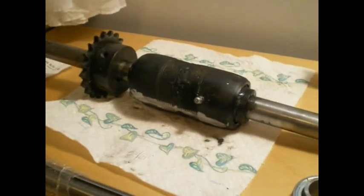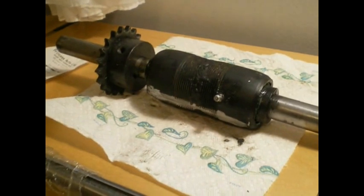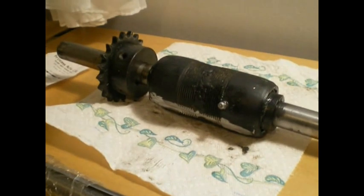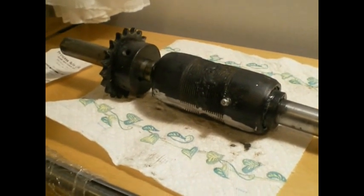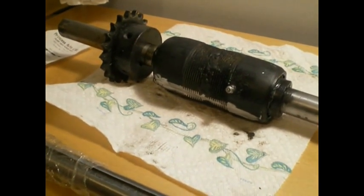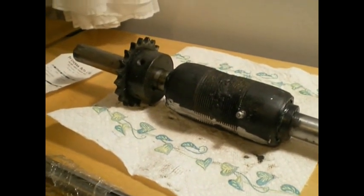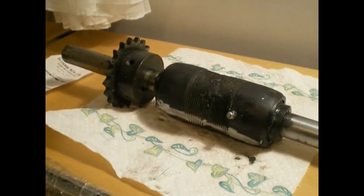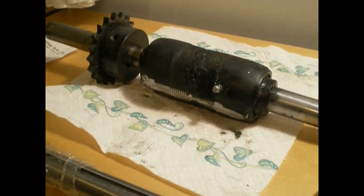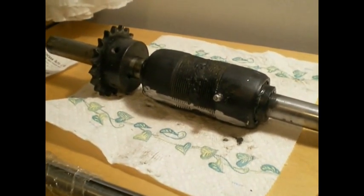Instead of using the pillow block bearings, I basically used my own stuff. On my pusher power trailer from my last couple of videos, I used those pillow block bearings — they're okay, everything works fine. But I'm not a welder by trade by any means, and I did weld basically to cast iron, and that doesn't stick well at all. Even with pillow block bearings, drilling the two holes with one bearing didn't really work out. It needs to be absolutely perfect, because if things are not in line the chain is going to fall off and everything is going to go sour from there.